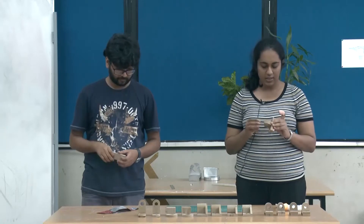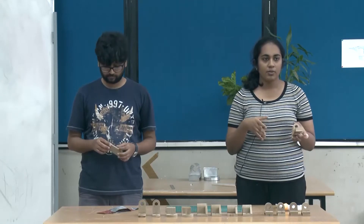One of the materials we have worked with in the studio for making models is MDF board. MDF basically means medium density fiber board. It is an engineered wood product made from hardwood and softwood residues, which are made into fiber mixed with resin binder and then formed into sheets by applying a large amount of pressure.